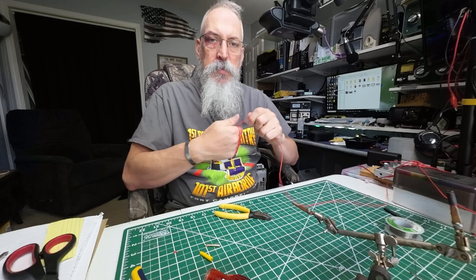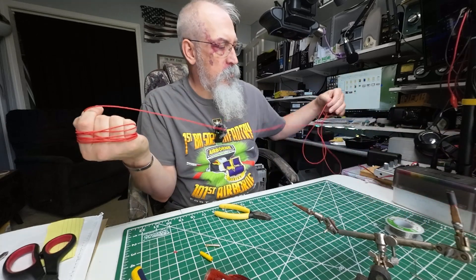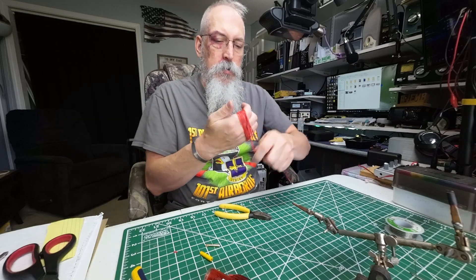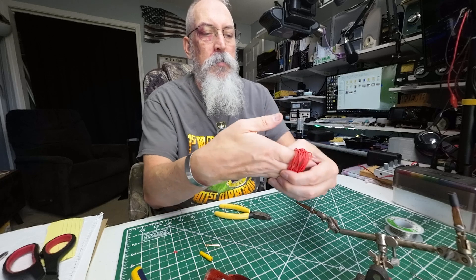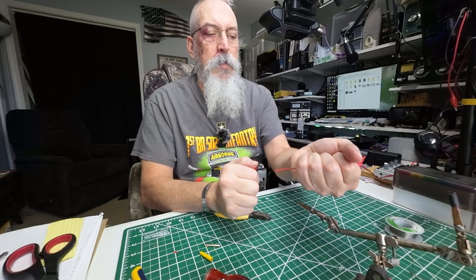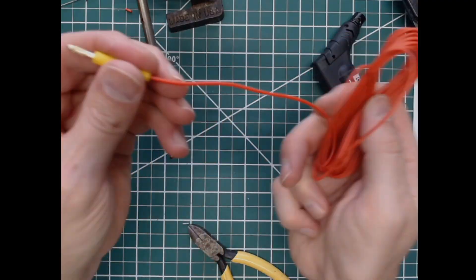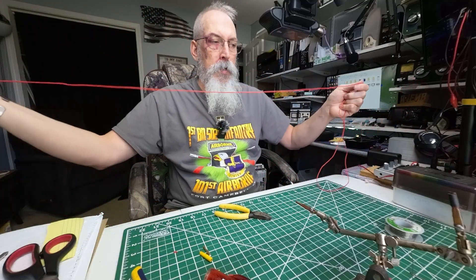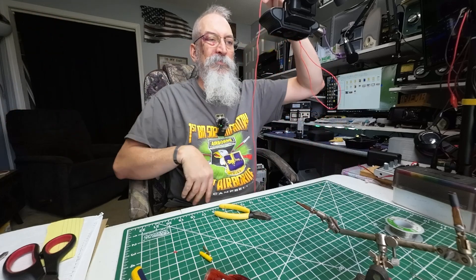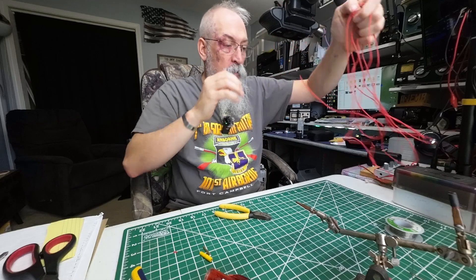Hope you like that tip on how to replace your MC750 radials with the Amazon silicone wire. This is how I wrap it up when I'm done — I usually just wrap it around my hand and pull it off. Then I go up to my antenna, plug that in and just start pulling it out. And look — no kinks, no kinks. It's great wire. Okay then, let's go ahead and cut this off. Thanks for watching. I'm Ed, W4EMB.